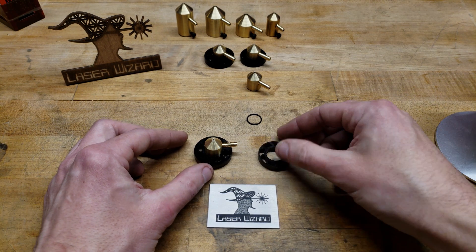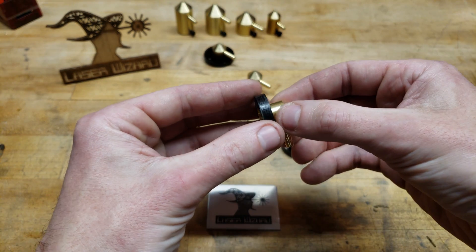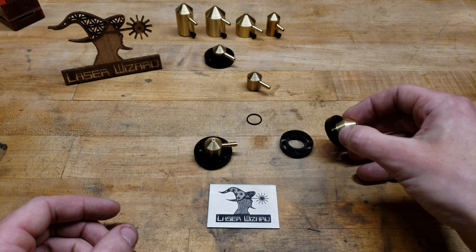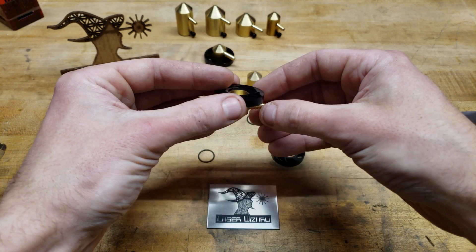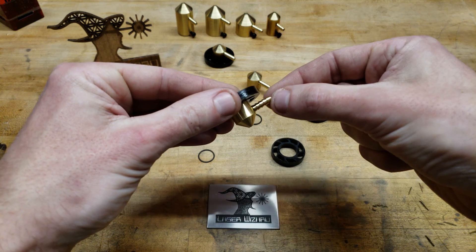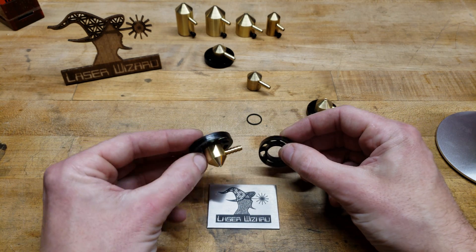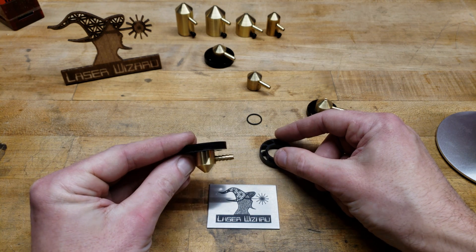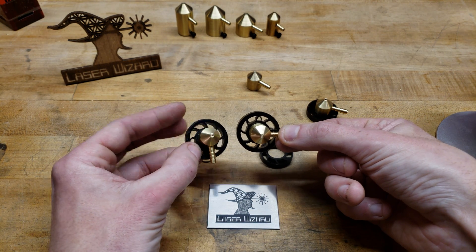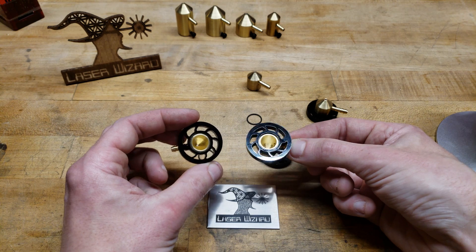The reason I include this second adapter is that this one's a little bit smaller and will actually fit inside the inner diameter of that cylindrical laser shielding. What I recommend as a first project — you could use your laser to cut out a hole in the side of that tube so you can run the air inlet. That's really what you need clearance for. I've designed the vents to match the vents on the module so that they restrict the airflow as minimally as possible.